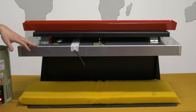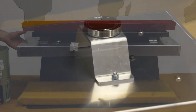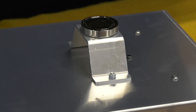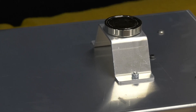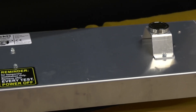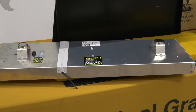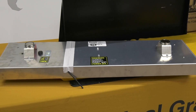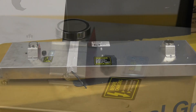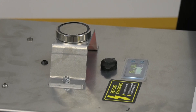A little bit about our carrier and what sets our product apart from other manufacturers: our carrier is a sealed unit. The pan actually fits up underneath so it's protected before you drop it, so you don't get any leakage from the combine into your pan that would distort your sample. We have two 220-pound magnets on top of the carrier that allow it to be mounted onto a back axle or feeder house header of a combine for grain loss testing.